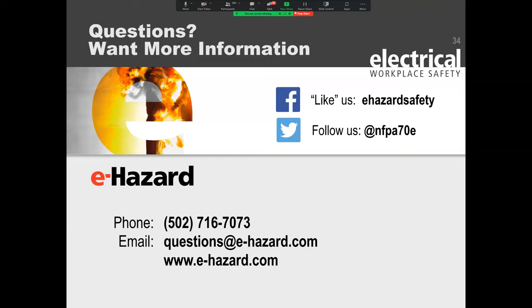For the rest of you folks, for high voltage environments, OSHA is very clear that no unqualified persons are allowed into this high voltage. Now you have high voltage utilities that fall under 1910.269. 1910.269 doesn't cover any unqualified person. So if I take a person in there to pull weeds, for example, or to spray something to kill weeds, that person needs high voltage training that's appropriate to the hazards that they would experience. I'm not going to try and make them a high voltage technician, but I want to tell them that in a high voltage environment, here's 1,000 ways to die, and here's how you can protect yourself from that happening.